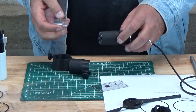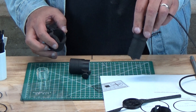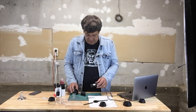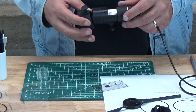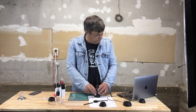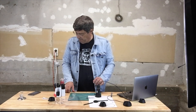Assembly is straightforward. Insert a bolt into both the top and lower sections, then check out the clear plastic section of your microscope — on some models it's glued on, but on others it'll just pop off. If it comes off with not much effort, you should probably remove it, as that'll help you get even closer to your object and increase the field of view at your highest magnification. With or without the clear plastic section, slip the microscope into the top part of our mount, push it down until it's seated as deeply as possible, and tighten the bolt. Then slip the microscope and top mount into the bottom piece with the notch lining up with the keyway, focus on something, and when you're happy with your focus, tighten the bolt to secure it. Your USB microscope and mount are ready for use.